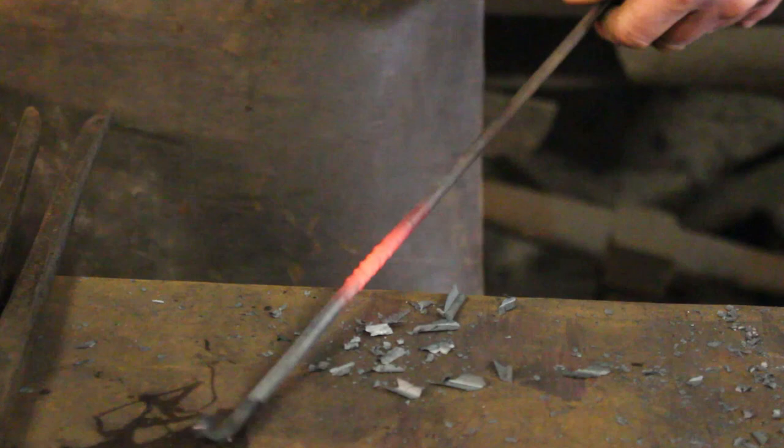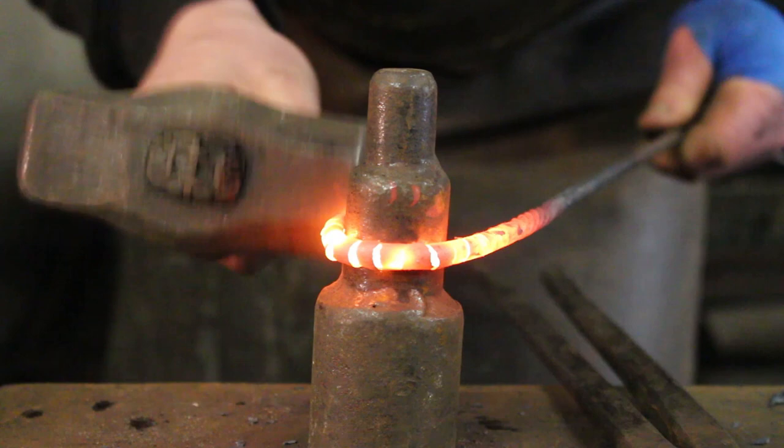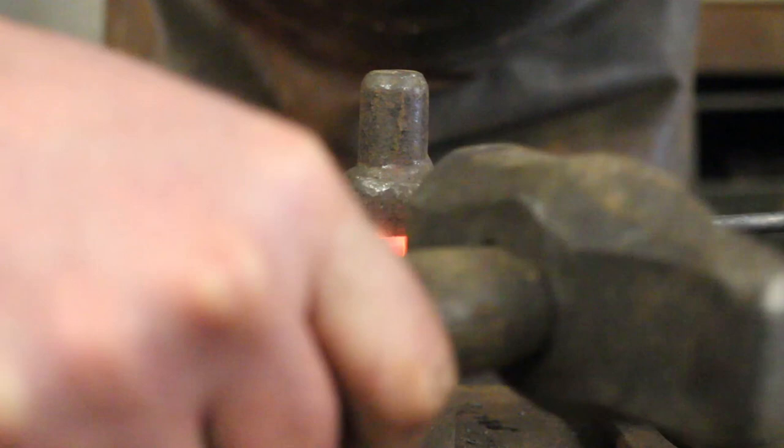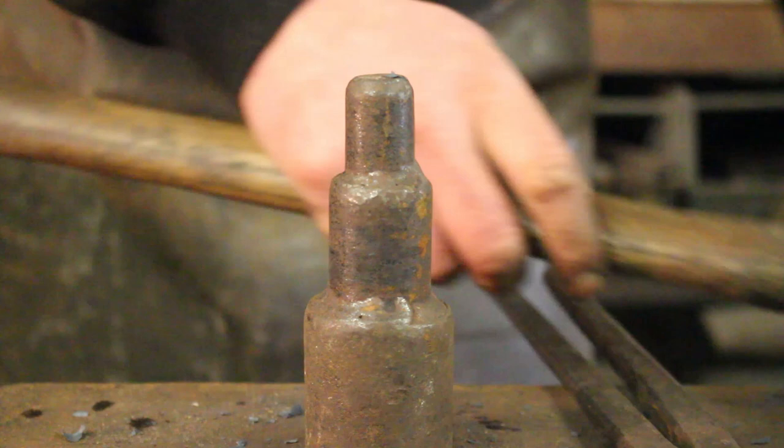It seems a long way away from my little scroll but by the time we've wrapped that around it should be nice and close. Taking it out of the fire nice and hot, cool off my little scroll, over to my hook mandrel. I can now hammer my little scroll because I've quenched it off and pull my material around. If you end up with a bit of a lazy bend in the back there, just give it a touch of the hammer and straighten it up.